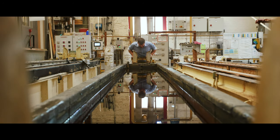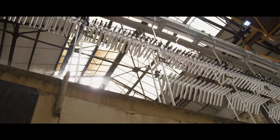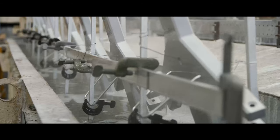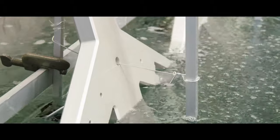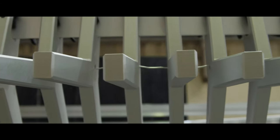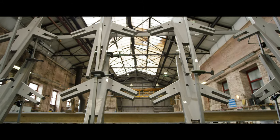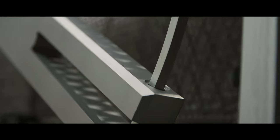The anodising is a process which unifies the surface but also stabilises it, so you don't get oxidation and pitting or marking on the surface, which should allow the piece to be very resilient for a number of years. It's quite a mystic art, anodising — very susceptible to the impurities in the material. We're trying to get a universal colour to go from the very thickest material to the very thinnest, so the real challenge is achieving consistency of colour throughout the form.